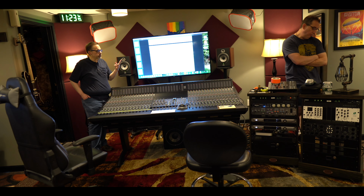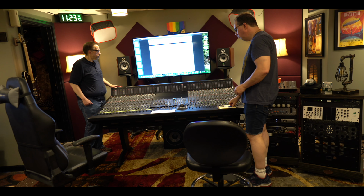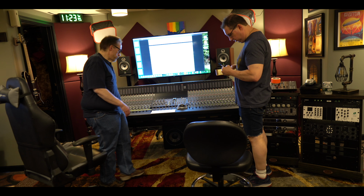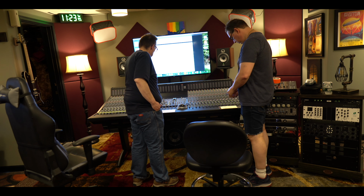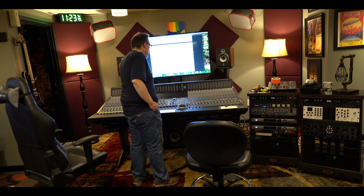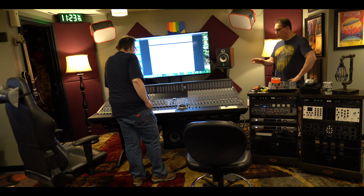Okay. Yeah, well, I should probably do that. Is it two more or is it four more? No, it's two. It's one, two, three more. Nine, yeah, 16, right? Each one is each, so eight. We need four 10-foot cables. So you need four 10-foot D-subs, and that'll let us send audio back in directly into the X16. And that lets us repurpose the other three direct outs that we're not using. Okay, so then we'll be able to print the eight groups back in, yep.